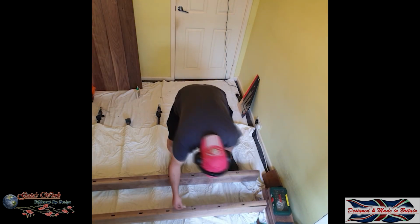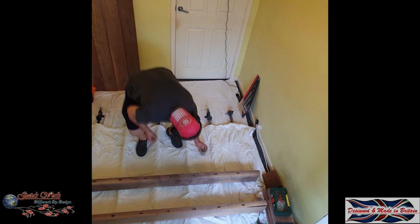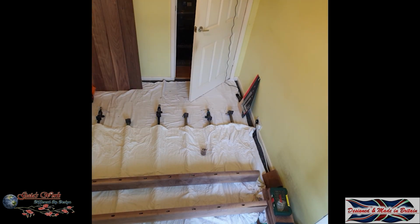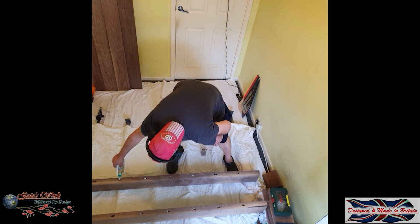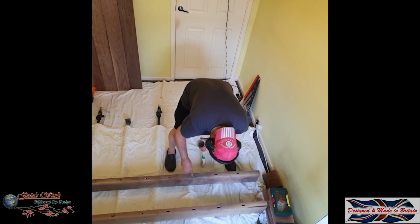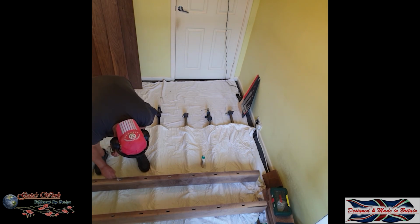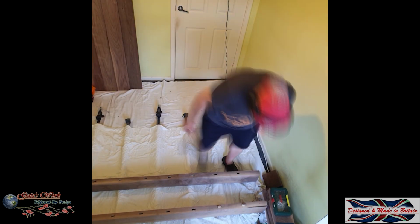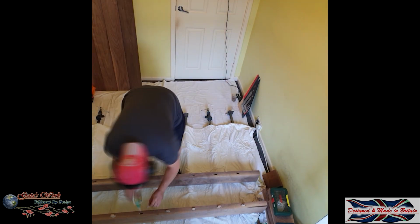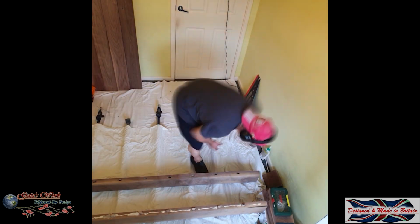Now, as you see, I take my time with the glue. I make sure all the holes are evenly filled with the glue. Now you will see that I'm going to place the dominoes inside and then place them back with extra glue. I will give enough glue, plentiful glue actually, so the wood is able to absorb it and have a better grip.